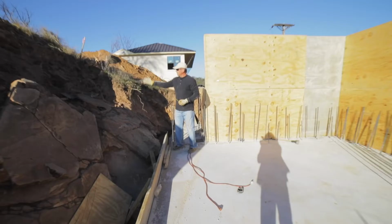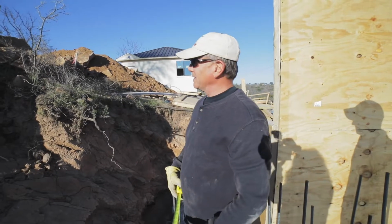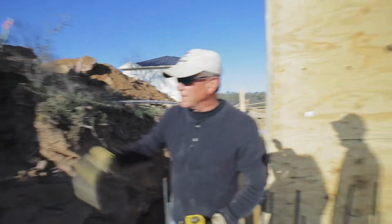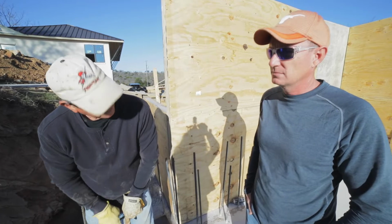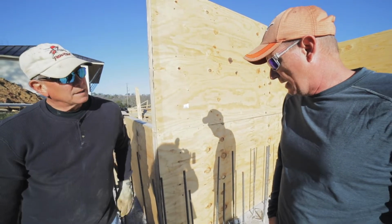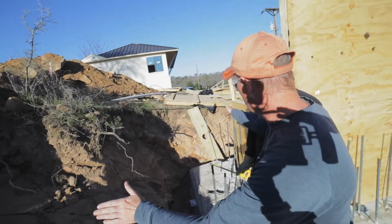It's going to come up here, right? This wall right here just continues straight through. But I'm looking at how we're going to fill this in. I think the best route is I can put a 21-inch batter board there, right against that one, and then start running 2x12s across, and then just fill in. Now, I'm thinking about drilling dowels on each side of this 2x4, so you'll have to sort of hold it. And then on this side, we get our saw and cut that rebar off right there. Well, I'm not following 100%, but what I'm thinking is when we get the steel here, we'll run the board right through here, and then the board comes on through, and then we turn over that way. This side here, we'll continue it over, and we're just going to flood it with concrete.